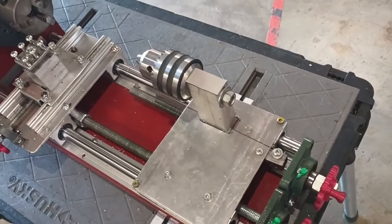I next cut out and worked the motor slot so the drive belt could be properly tensioned. The bolt holes were then marked out and drilled, with thick bolts holding the headstock channels securely in place.